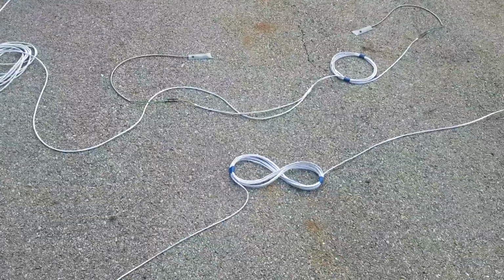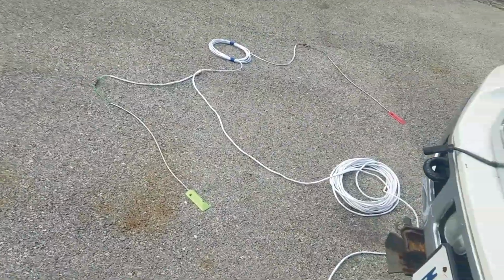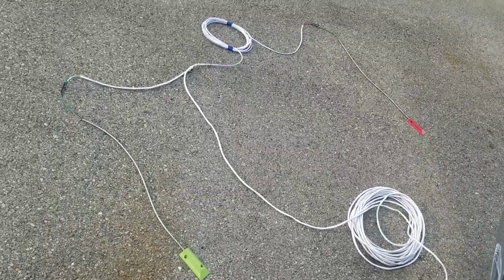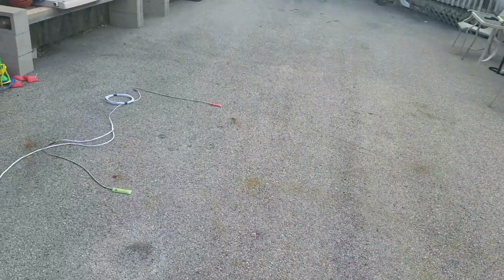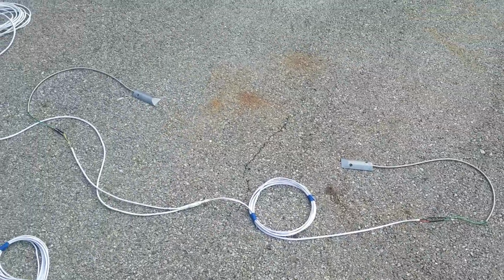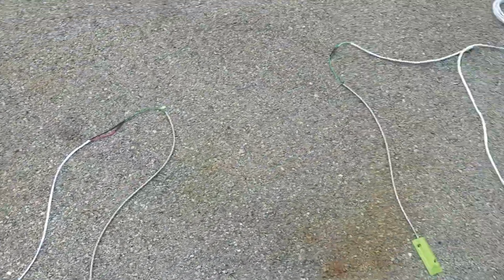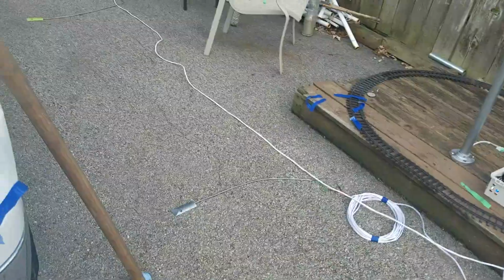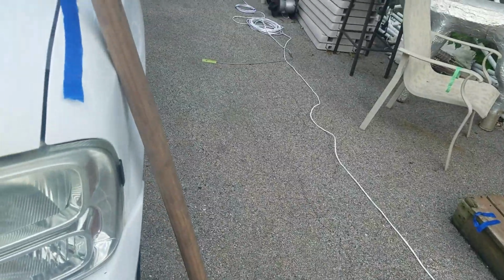What I was talking about on the Y crossing, if you have a train coming from the Y side, which is by the driveway, and he passes the green but stops before the timeout magnet, another train coming from either direction will go through. I have it wired up now so all the timers and the green magnets will interact with each other, because if you have one train parked and another train coming through the other straight direction or vice versa, all the tracks are wired up now so you can park one and the other one will come through.